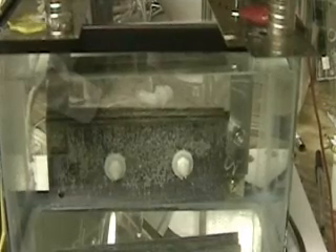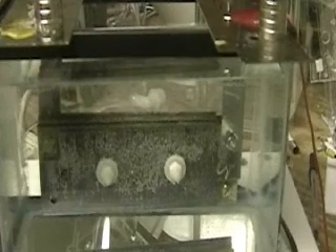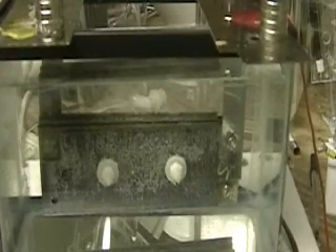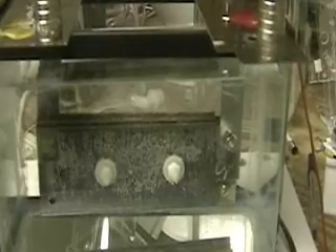If you want to contact me at johnarons@hydrogentap.com, I'd certainly be glad to correspond with you. This is just another one of those intriguing questions we have — more questions. You can also go to my site hydrogentap.com and see the focus cell, which is what you're looking at here. I don't have much lye in this so it's not producing that much. The focus cell, including this one, has 11 plates: 3 positive, 3 negative, and the rest are neutral or blank. I usually have that cell in the upright position — the only reason it's laying down now is so we can see it all at one time.